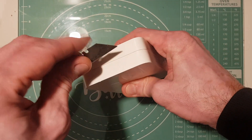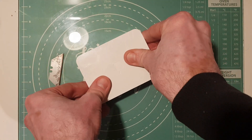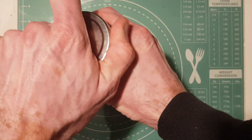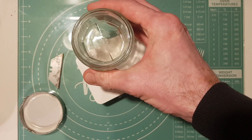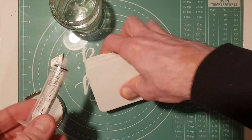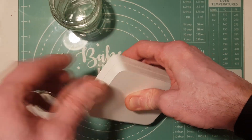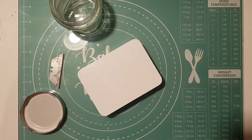First up, we're going to try and get into this using a sharp blade where it's glued together here in the middle. In order to loosen the glue, we're going to use some petrol in a jar along with a syringe so I can dribble it into the gap, let that soak, and then use the blade to try and prise this open.